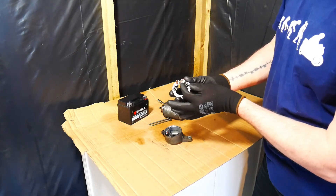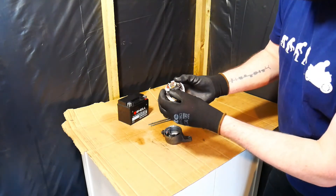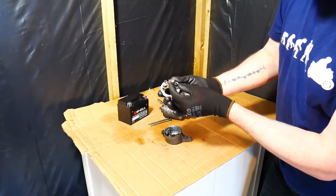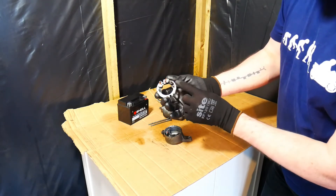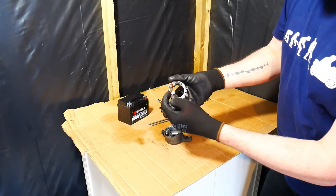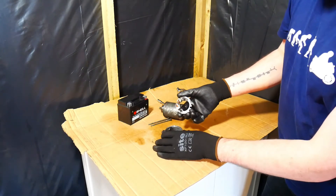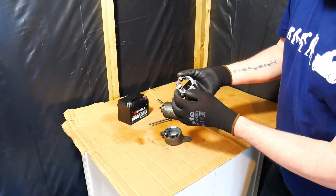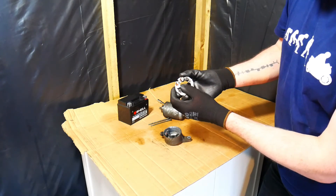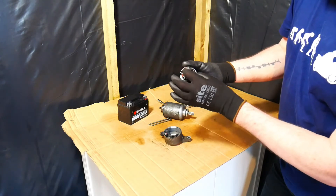The carbon brushes are spring-mounted — there are two of them, one here and one here. You can see they're made from carbon or graphite and they're spring-mounted to keep them pushed out towards the center. I can push them back because of these little springs. This copper-colored material is just copper wire, and it connects to these little carbon brushes — you can see the copper wire moving when I push it back. That's where the current comes to these brushes; the current flows through these two brushes.